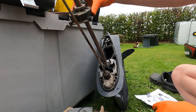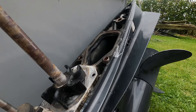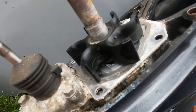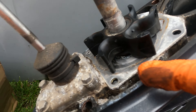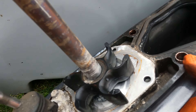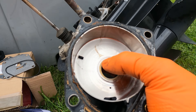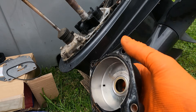There we go — it's coming up. We'll lift the housing off first and we can see the impeller. The impeller seems to be in okay condition at first glance — no loss of blades, we have got a bit of compression there. The wear plate is not looking too bad, and the inside of the housing is not too bad either — a bit of indent where it's been running, but overall not disastrous.